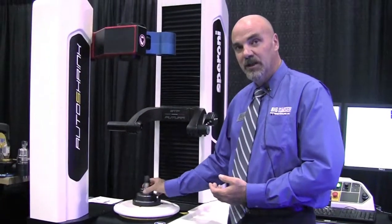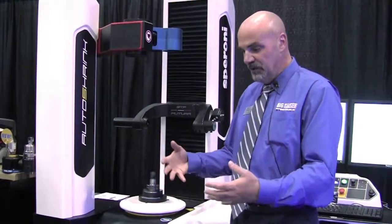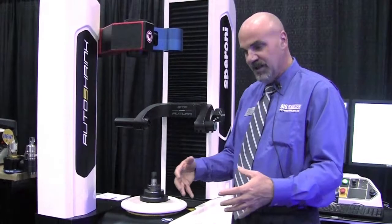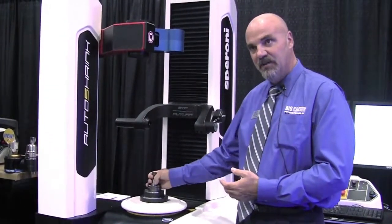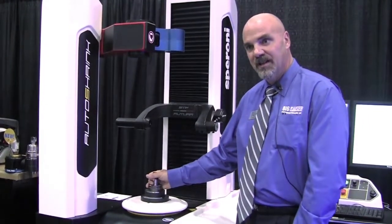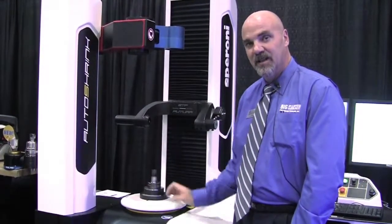The accuracy — we can literally tune this to plus or minus 5 microns. So if you're running multi-spindle machines you'll be able to set up all the spindles at the same dimension. The other way it helps out is the speed of setup. If you're doing a hundred or more shrink fit tools a day, this has the capability of setting them up very rapidly to help maintain that setup.